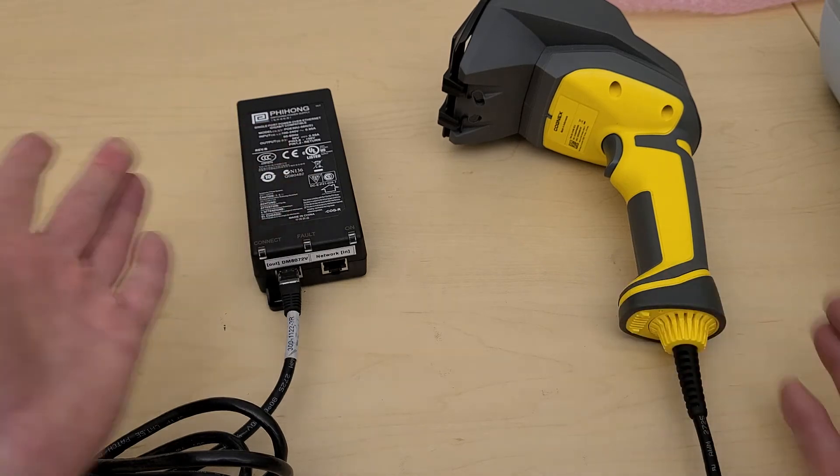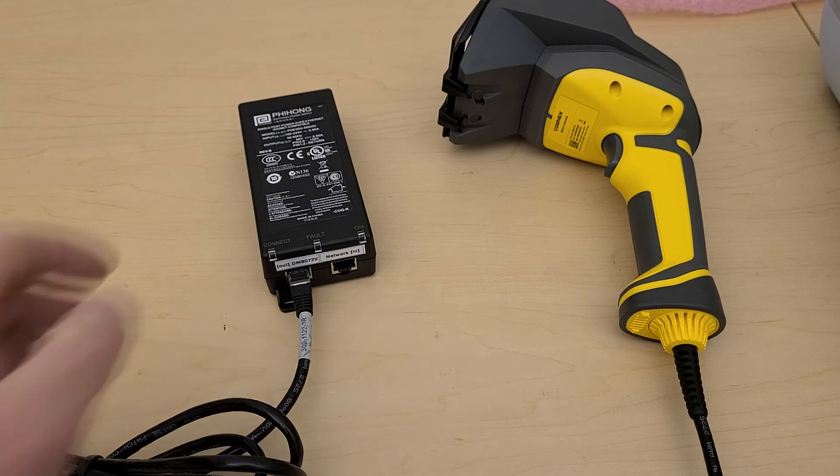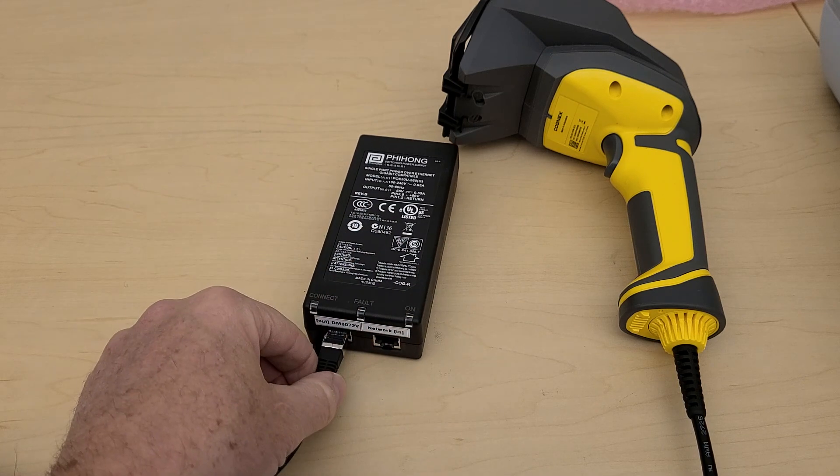Anyway, that's the difference between the two. Of the two, I prefer the Ethernet one — it seems easier to configure. The biggest problem we've had with the USB ones is that they come with a driver that can conflict with some other products used in the marking world, because it's a USB virtual comm device that gets mapped to an internal IP address — it's a funky driver. If you have two different devices plugged into the same PC, they conflict. So I'm getting more trouble-free connectivity through the Ethernet-based one.